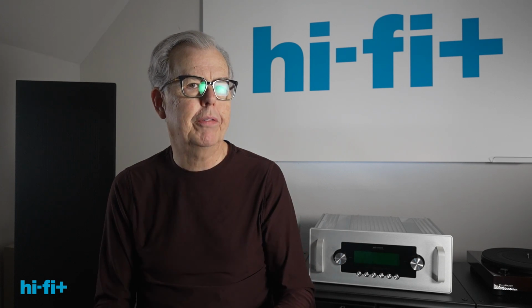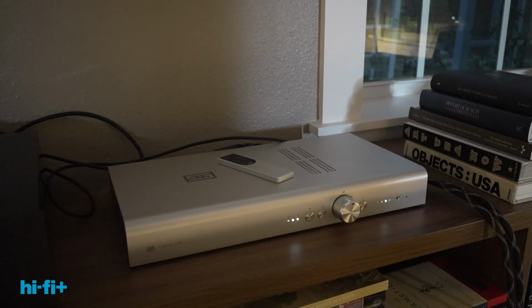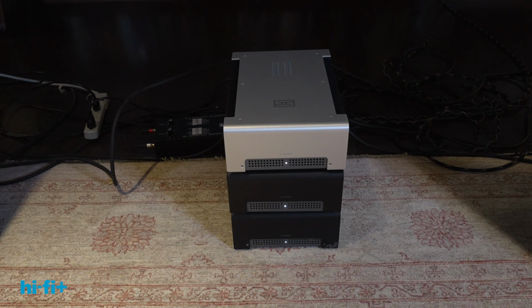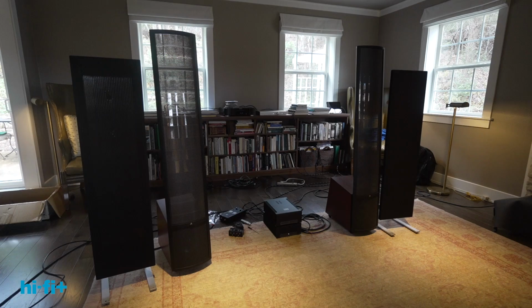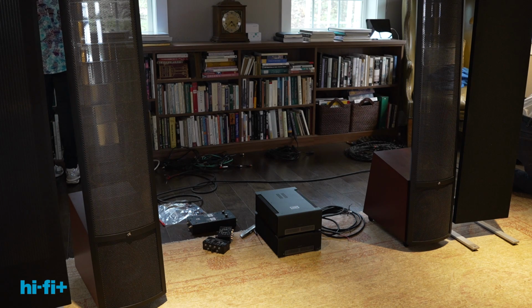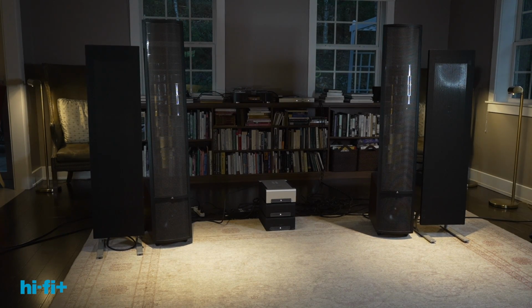It is a passive woofer, so you have to use an external power amplifier. Magnepan came to our listening room and set up the system. They used electronics, so we had a single stereo amplifier on the two UBS woofers, and I think 100 or 150 watts per channel, so not a giant amplifier for sure. And we paired them with an interesting combination, basically an electrostatic speaker, to demonstrate that the UBS could work effectively with a very quick, highly respected form of loudspeaker, an electrostat, but a form of loudspeaker that's often thought to have difficulty reproducing low frequencies. So that was the demonstration conditions, and I'll be back in a minute to talk about how it sounded.